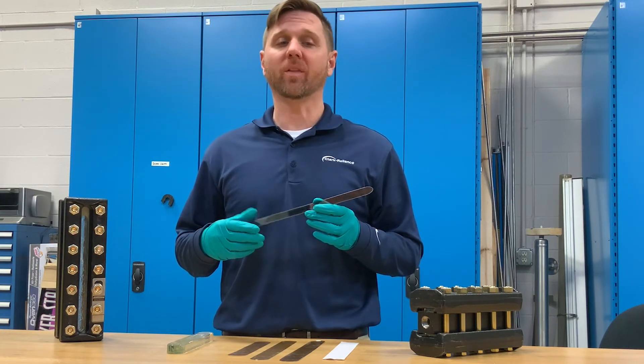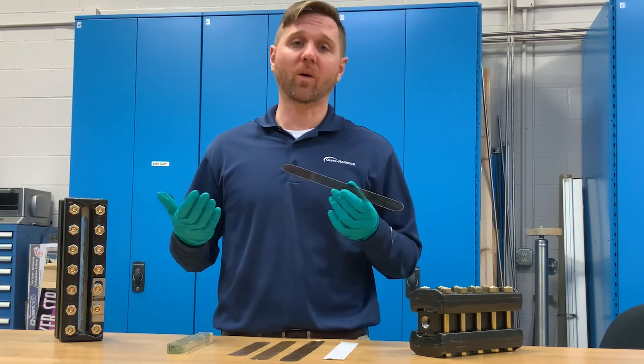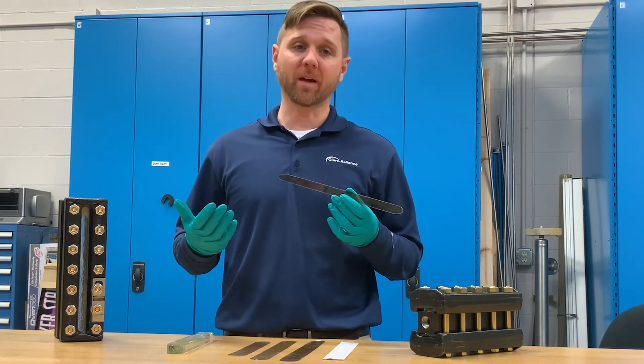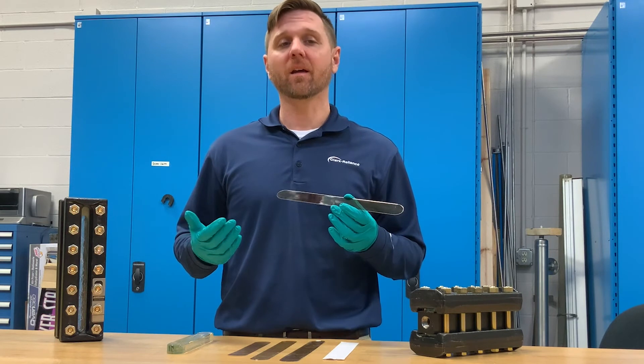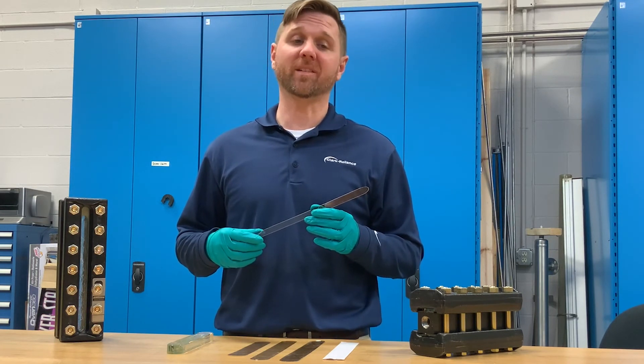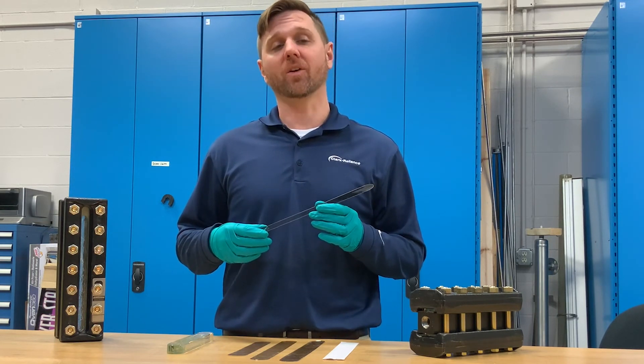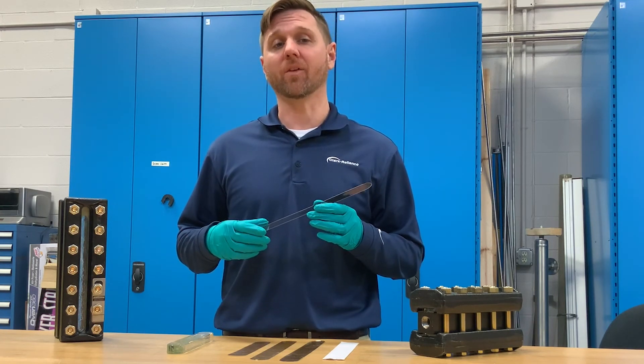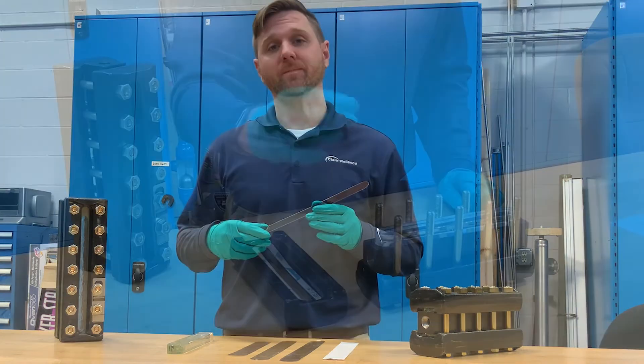Jurgeson mica is sourced as V2 with air inclusion as a V4, which is a high quality grade mica. We offer two different thicknesses, and honestly the thicker the mica, the more protected it's going to be. This may not be the case with other resellers or manufacturers. Jurgeson OEM parts must be used in order to maintain the pressure and temperature rating of the unit as well as avoiding voiding the warranty.